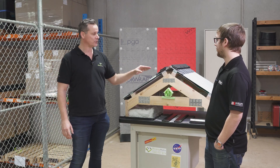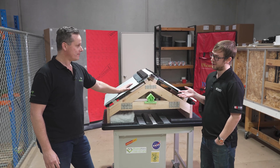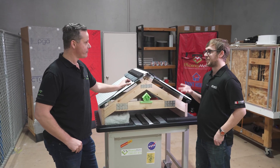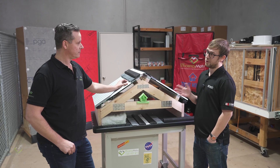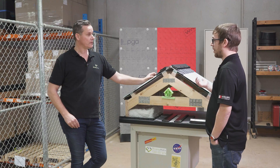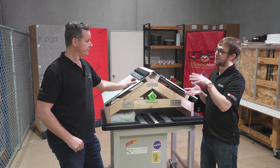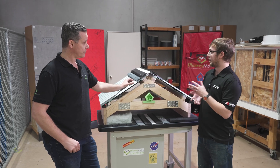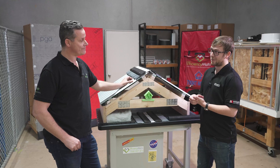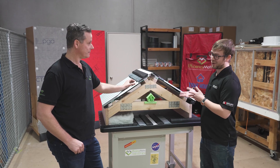Not all roofs are equal — where is this ventilation required? This is specifically for pitched roofs. There are a few exceptions in NCC 2022 where you don't have to do any of this. The first is concrete roofs — flat roofs, balconies above living space, no ventilation required. Another exception is SIP construction — structural insulated panels — because they're sandwich panels that are essentially air and vapour tight on both sides. Also exempt: building in a flame zone in one of the BAL regions, where the risk of fire far outweighs the risk of condensation.